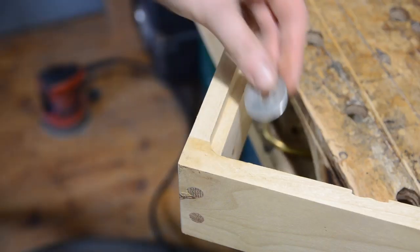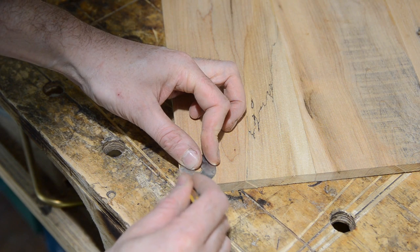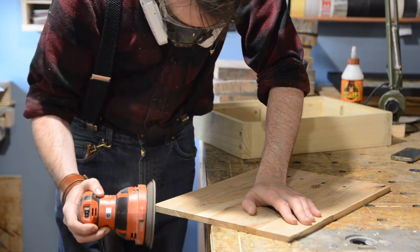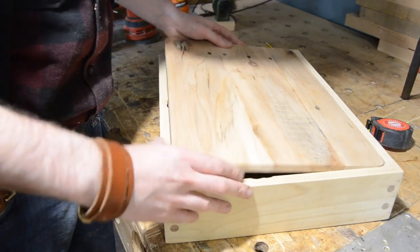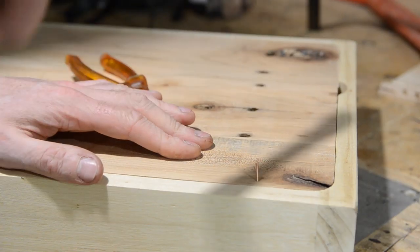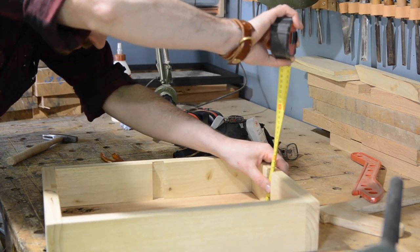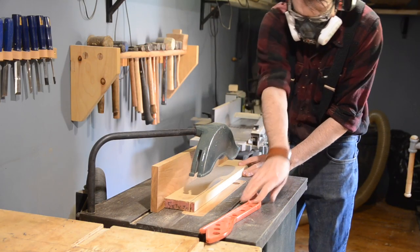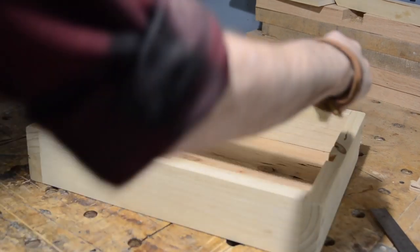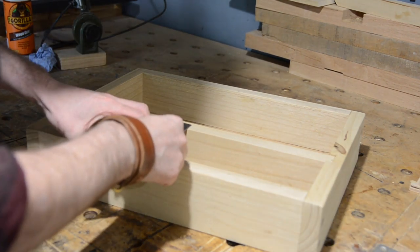Because I used a router to cut the rebate it's got rounded corners, so I find a washer with the same profile and then I can get this drawn onto the panel. I then use the random orbital sander to sand down to my line rounding these corners off. The panel now fits into place. I don't want to glue it - I'm just going to nail it in with some little copper panel pins. So I don't repeatedly hit my fingers I just hold them with a pair of pliers and tap them into place. I now need to get the internal dividers in place. I have the wood I ripped down for the box but because of the back panel it now needs to be slightly thinner so I rip a little strip off. I can get this divider in that separates the space between the bottle and the glasses, but now I want a little shelf to go in so I can get two glasses in there in case I ever have a friend.